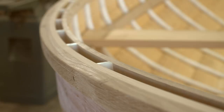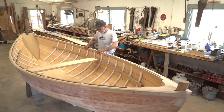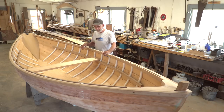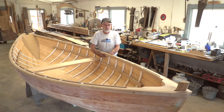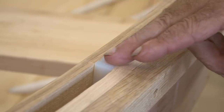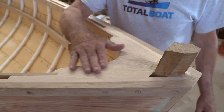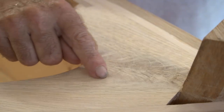We've got the in-wales on both sides and the out-wales. We riveted right through at the frame heads and that came out nice and tight — and that's strong. The heads of the frames look a lot nicer than I thought they were going to look. We've decided not to put any caps on it, partly so that when you've got a little water in the boat and want to tip it out, it doesn't get caught under the guards. We'll just put pads where the row locks go. The breast hook really came out nice — it took a little figuring to get the grain lines centered right down the middle of the boat.